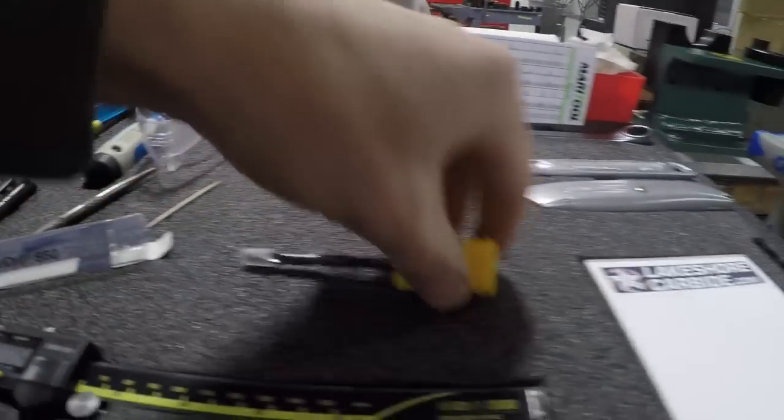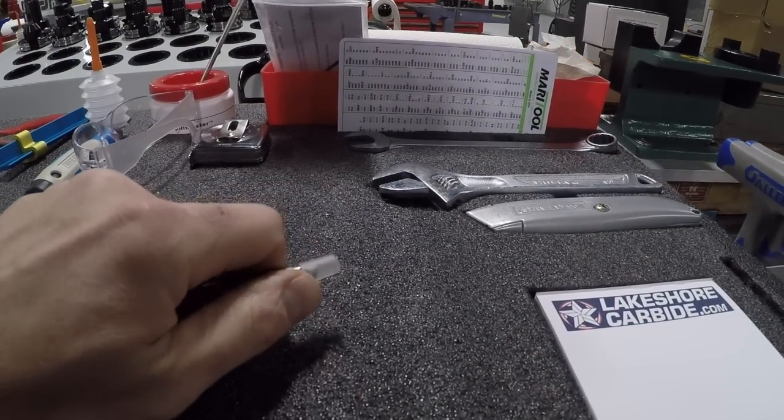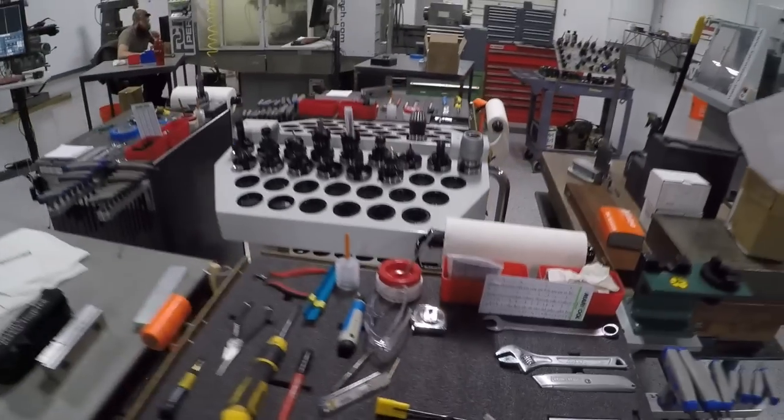Here is that Sandvik Coro drill 860 - a carbide through-spindle coolant drill. That drill was about $180 and should last for 17,000 holes or more according to the Sandvik spec. We're going to run it at 15,000 RPMs at 150 inches a minute, no pecking, straight through one inch and change of aluminum. We've been using a 150-degree parabolic drill - thanks to Tim Paul - about $36 from McMaster, running it at about 70 inches a minute. So the long-term question is: is it worth doubling the speed for five times the price?